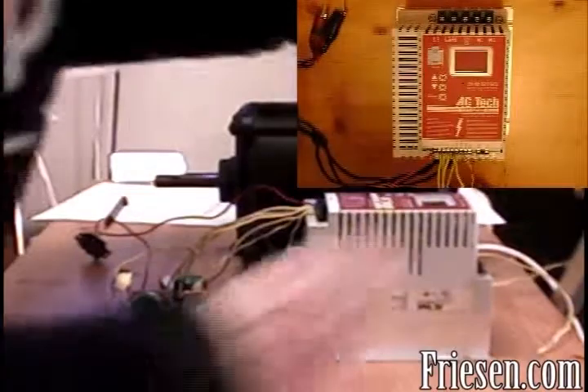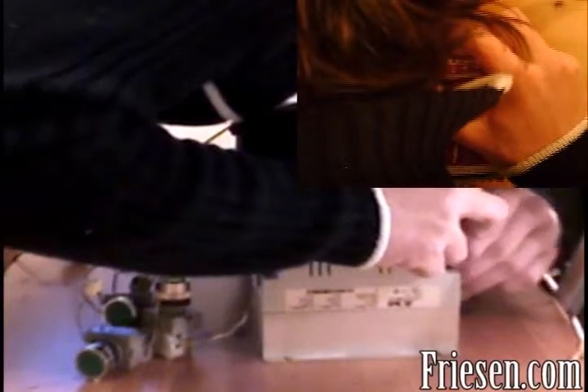Lastly, we'll connect power to the circuit. On the top of the drive are the connectors L1 and L2. Also on the top of the drive are the connectors B negative and B positive — do not connect power to these connectors. It will fry the drive, and this is not a warranty issue.